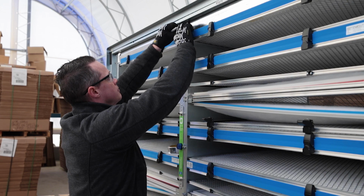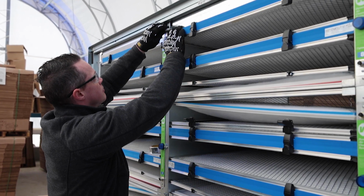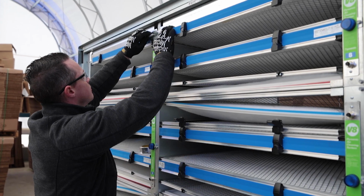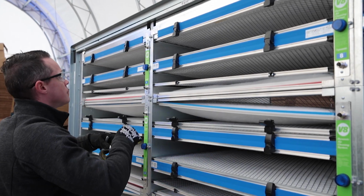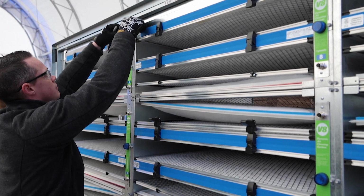Seal any gaps and seams in the flashing using aluminum foil tape or caulking. If possible, position one person on the downstream side and one person on the upstream and check for gaps using a bright light.